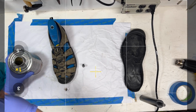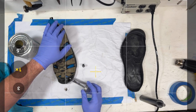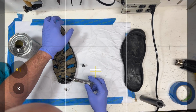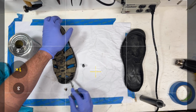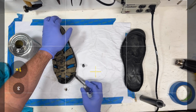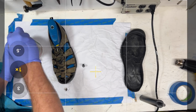They're going to actually have like 5 or 10 gallon cans, or liter cans, and they're going to dump out the glue, but then they're going to catalyze it, right? So their glue is only good for an hour or two, versus this glue, which is good for months. And that catalyzed glue just really makes a nice strong bond. But this stuff works well if you're just careful with your surface prep and put enough on it.